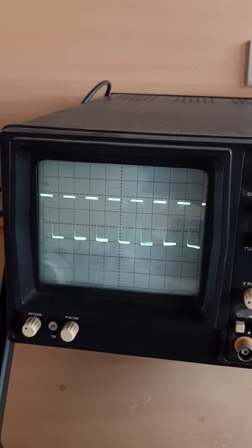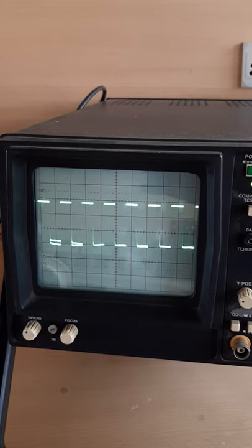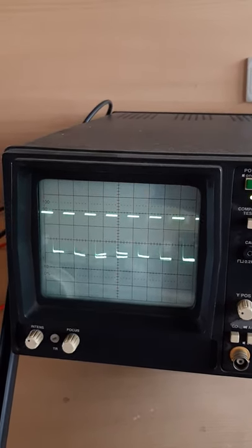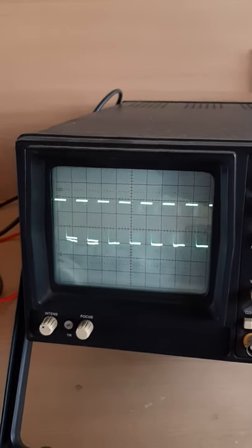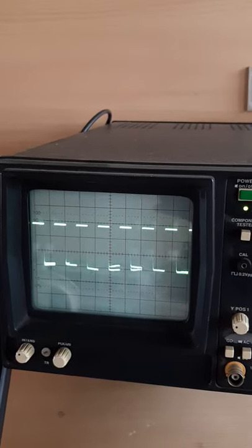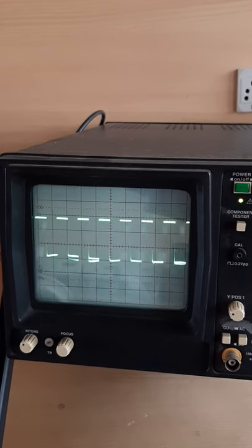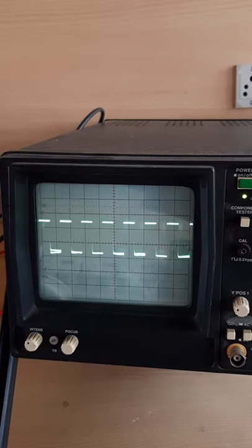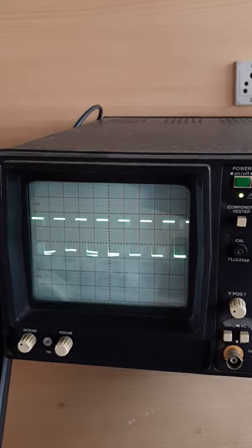Dip means a reduction in the amplitude. So here, when I am rotating this frequency meter, whether you can find a dip. See, continuously rotate it such that at one point you will get a dip. So it will take some time, you should be patient. So one dip is found, you can see here. Okay, this is the first dip.